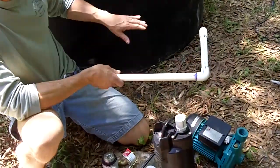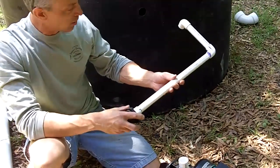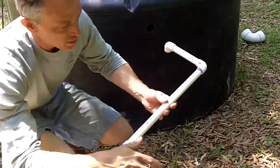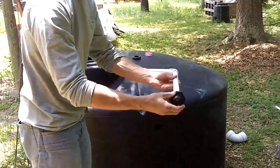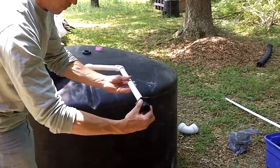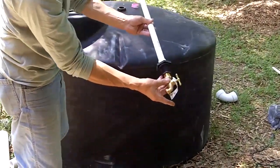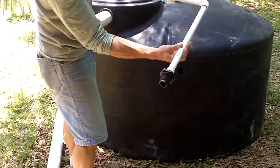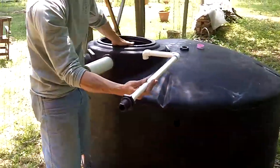To deliver the water conveniently in this tank, we have this internal piece of plumbing that we're going to put in the tank. Gravity-fed, you would need it down here. What's nice about this is, since the pump is going to be inside the tank, this will actually sit and come out of the tank. This is the bulkhead fitting, and your valve will be here on the outside of the tank. This will fit in, and I have this elbow in so that the pump rests right below this access point.